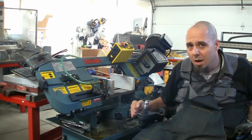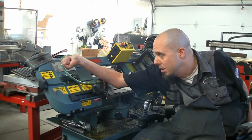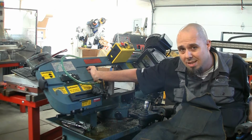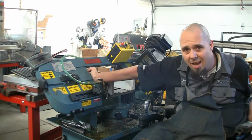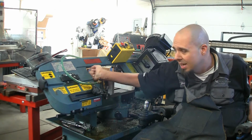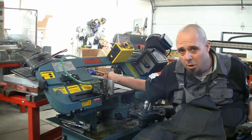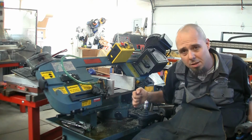First, just a couple things I upgraded. You can barely see it there in the corner, but there's a weight that I bolted onto it. I need to go a little bit heavier. JT had warned me this thing gets a little vibration in it from time to time. The head is just kind of lightweight, so to damp down some of the vibrations, it needs a weight out there. Probably going to go to a bigger weight, and at the same time tension up the spring a little bit on the back so it's easier for me to lift it. Lifting it's a little bit of a challenge.